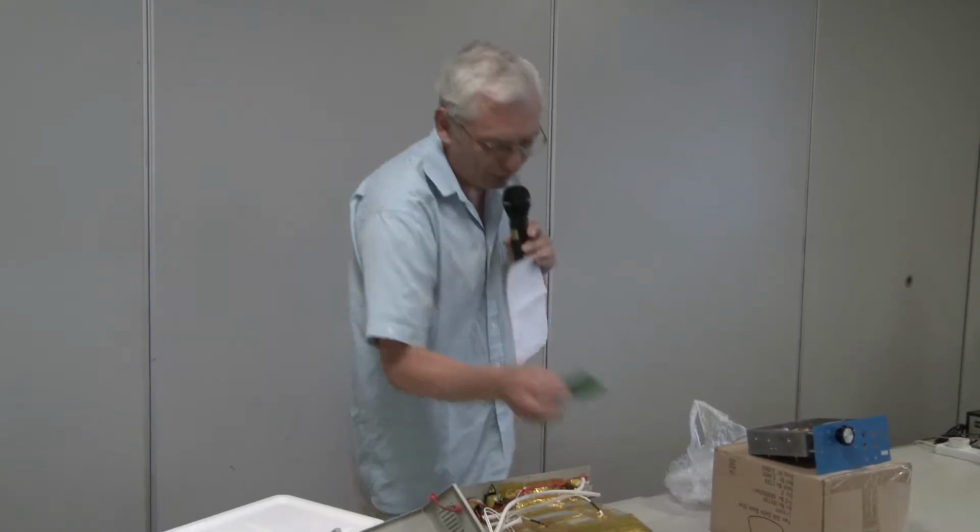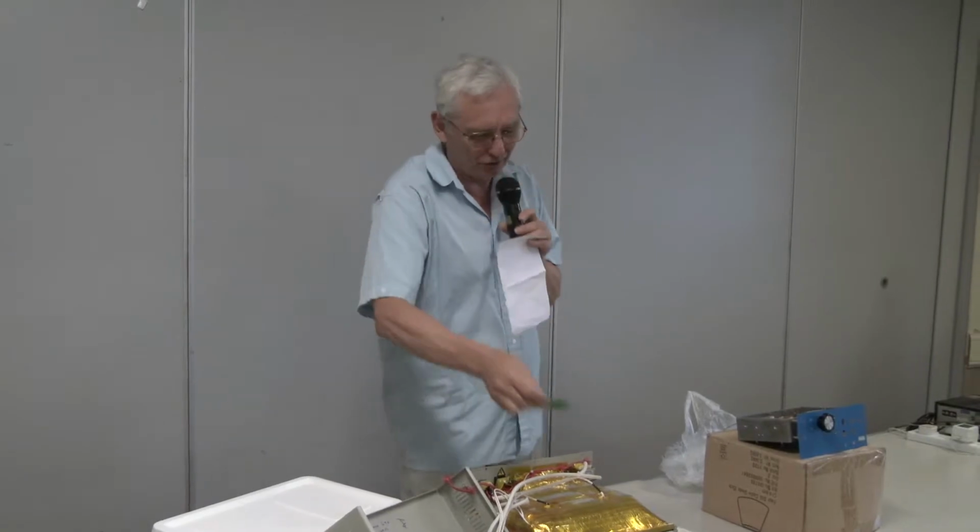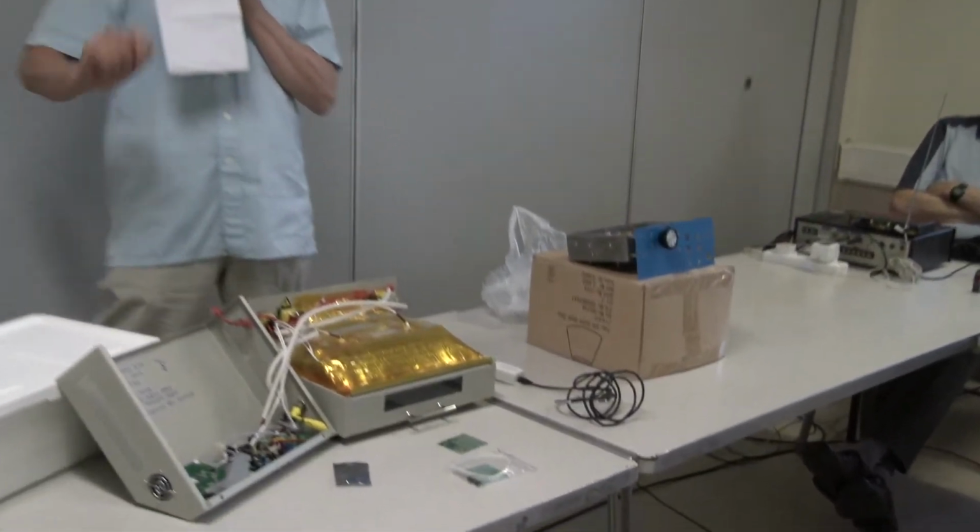Have you tried the chips that have got all the pads underneath the package, including one in the centre for heat sinking? Not yet, but that's going to be the next test, because that was my driving force. A lot of chips now are leadless, and you can't do them with a soldering iron, and a lot of them have heat pads on the underside. But I can't run before I can walk. At the moment, I'm barely walking. So once I know how to get this solder paste to work better, and I'm pretty pleased with this. I mean, this board would work if it was a board. I look at it under a microscope and I think, well, some of those joints aren't quite as nice as I'd like, but that will be my next step.